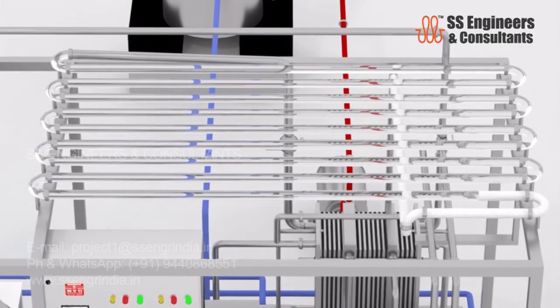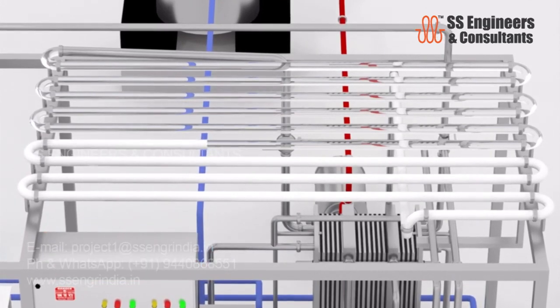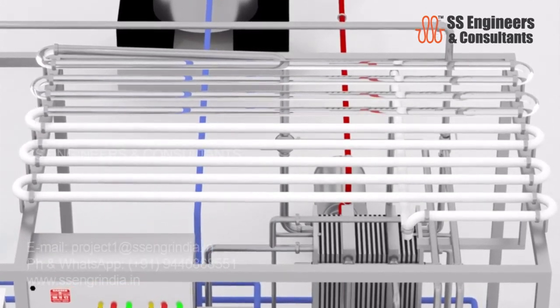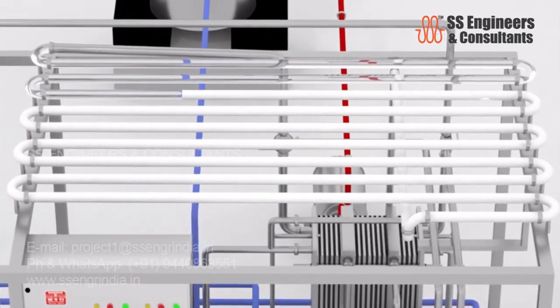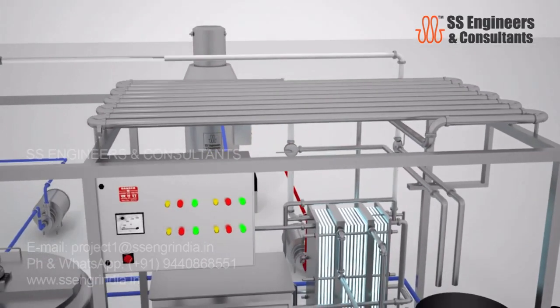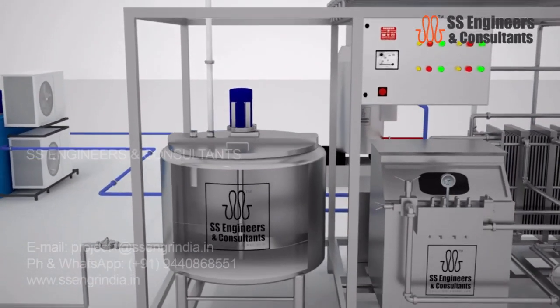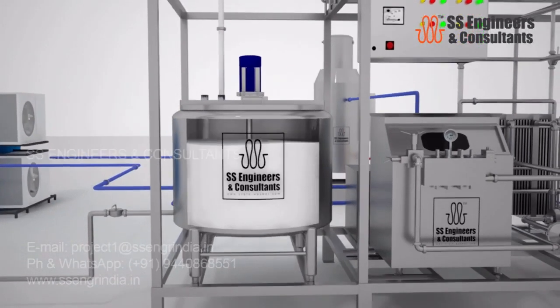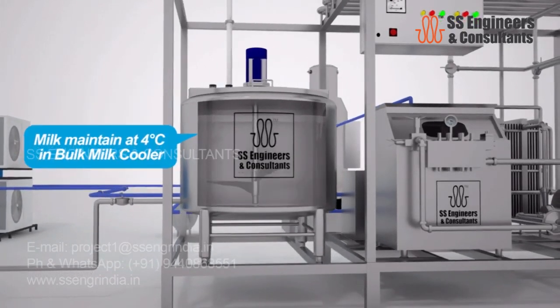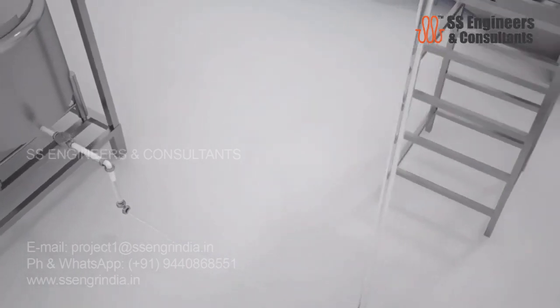The milk is kept on holding for 15 seconds through the holding coil offered with the pasteurizer. Here the pasteurization process is complete. The pasteurized milk after holding is then rapidly cooled to get the temperature of 4 degrees. The chilled water from the ice bank tank is circulated in the pasteurizer to cool the milk. The milk shelf life increases to 48 hours through this process.